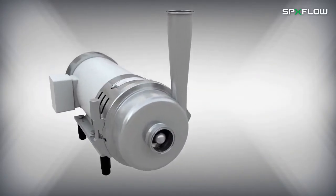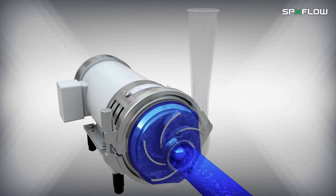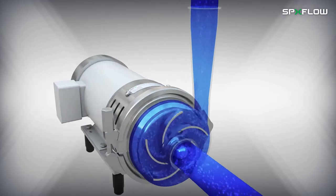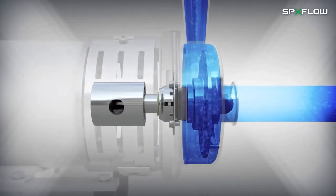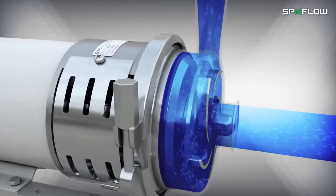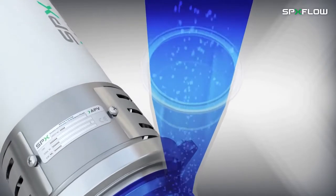The WPlus Pump series is based on a proven hydraulic design that promotes high operational efficiency and reduces noise and vibration levels while maintaining hygienic standards. Low viscous fluids enter through the center inlet and flow around the impeller, which turns at various speeds based on application requirements. The fluid then moves to the outer extents of the impeller vanes by centrifugal force and is directed through the outlet.